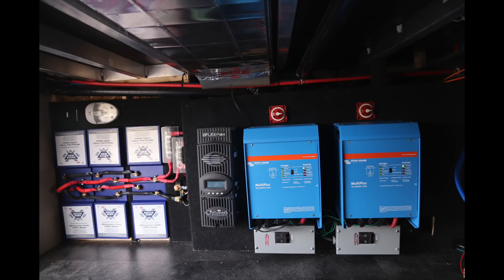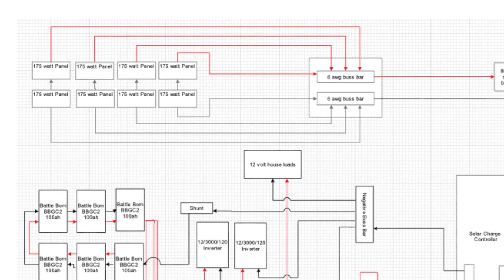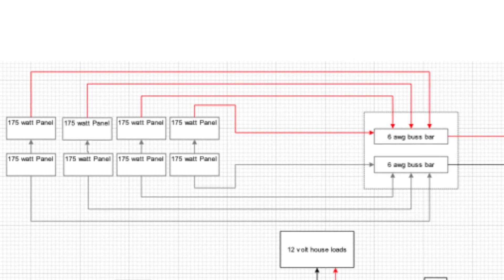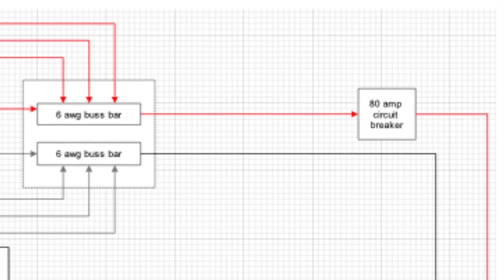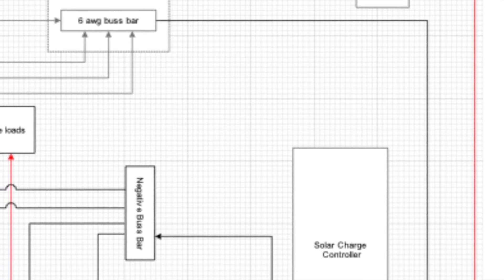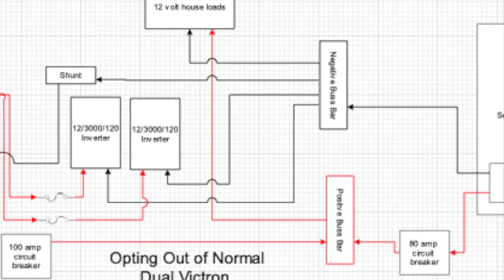I showed you all the wiring on my old system just so you could have a visual reference of what it looks like. It is exactly the same wiring for the solar charge controller currently on my new system — only it's laid out a little bit different and behind the wall. To tie it together with the flow chart: power comes down from the solar panels through the combiner box, across to the 80-amp circuit breaker, then down to the solar charge controller, where the outputs go to the bus bars which end up at the battery bank.